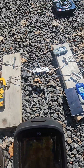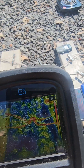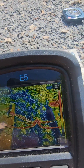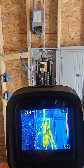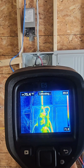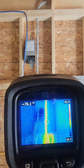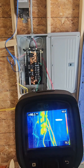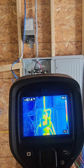At 6 minutes 18 seconds, this is what the thermal imaging camera shows. Thermal imaging of the panel I'm feeding the experiment from — it looks like a lot of red. But if you notice, it's only 75 to 90 degrees. Red doesn't always mean the same thing; red just means the hottest you're seeing. So if you look at the temperature scale on the right — it's one thing I don't like about these, they're a little deceiving. You see red and you think you're cooking stuff, but that just means that's where the hot spots are.